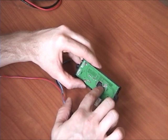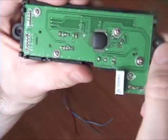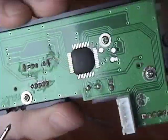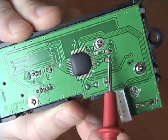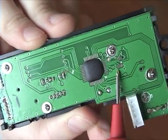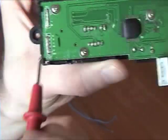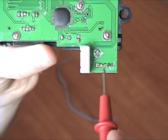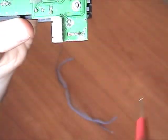There are two spots right here that we need to solder to — I'll see if I can show that on the camera. Right here and right here — these top two, not this one, but these top two. We'll also need to solder a ground wire, and I recommend that you do that off of these ground points right here that the USB cable was connected to. So let's go ahead and do that.